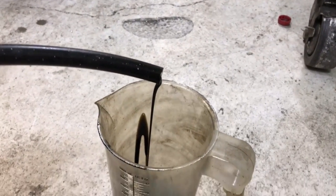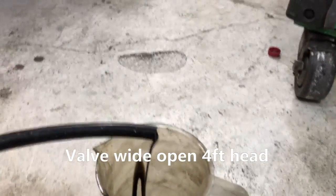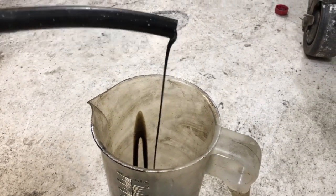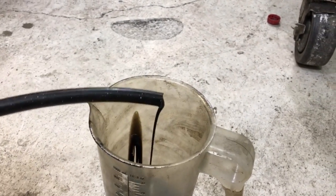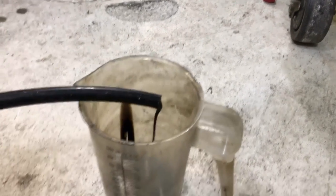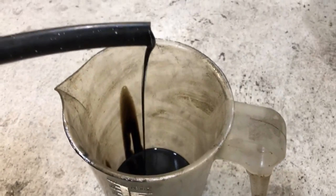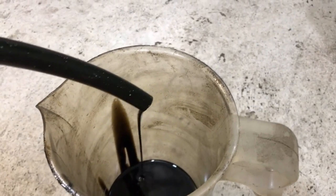Okay, we're shutting down. Here's the problem with cold oil and small hoses — see the size of the hose I have here. This is a 3/8-inch ID hose and it's just kind of small for this job. That's just enough oil flow for an oil burner to run there. So for very cold conditions, we're definitely going to want to keep this in mind and have much larger hoses and fittings.